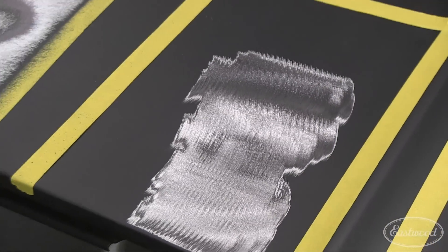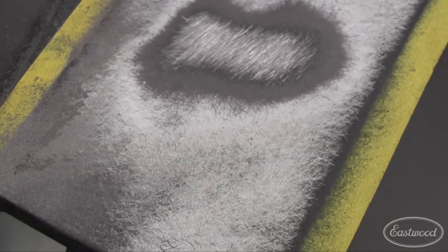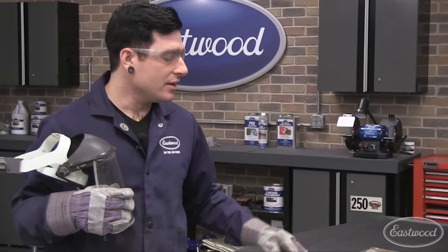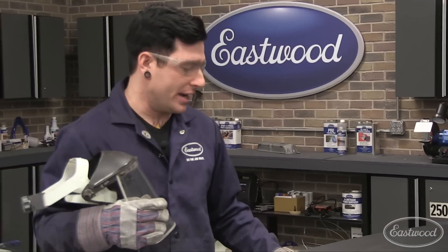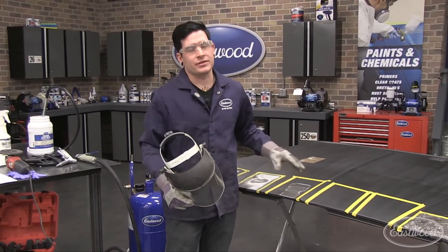You can see how quickly we stripped that down to bare metal — that was pretty fast. But you can see the difference in the profile. Those little scratches were from barely pressing down; if you press any harder you'll really start digging into the metal. The more you dig into the metal, the more work it takes to get it flat and straight. It's really easy with that tool when stripping a large panel to press too hard and get waves in your panel at the end — even if you prime it with high build primer, the waves remain because you're pushing tiny grooves into the metal. I also wouldn't use this near body lines and edges, because you can grind through the metal really fast and have a hole. So that's a good tool, but not great for paint stripping.